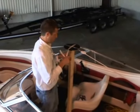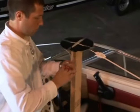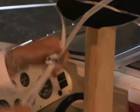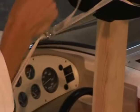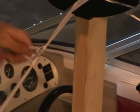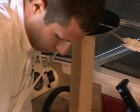As you can see we have two uprights in this particular boat. Generally speaking you want to be about 10 inches higher behind the windshield on a boat with your upright support than where the strap normally falls right on the top of the windshield. This will give us the slope so that snow and ice will run right off the cover. So we have a tight center support and Ryan is also pulling the side to side support nice and tight, so there will be no weight resting on the windshield. Buckles can absorb heat quicker than the shrink wrap.